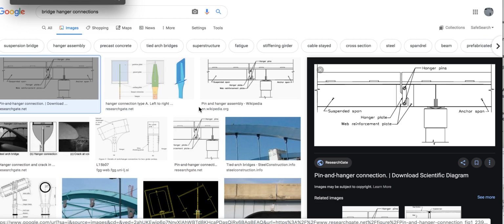Now you've got the dead load of the structure holding. It's trying to hold up also the span, but it's a very short span from hanger to hanger. But nevertheless, it still counts. The truck moves on. The two vehicles are passing each other, maybe three of them in a row. But they're overloading the structure. There's ripping. And I think I might be able to end this video with that until we get more data.